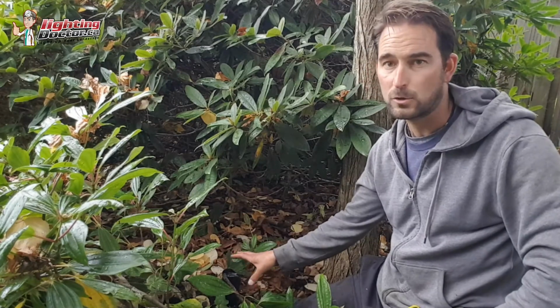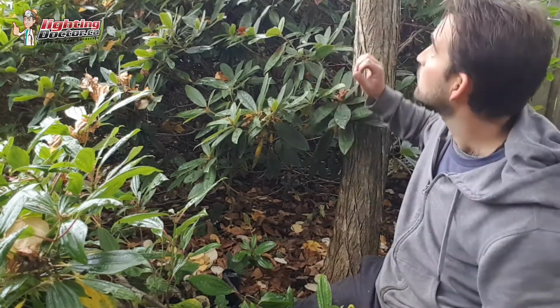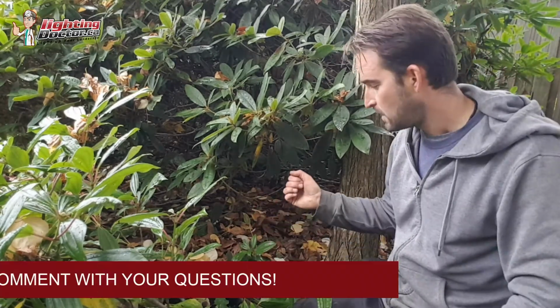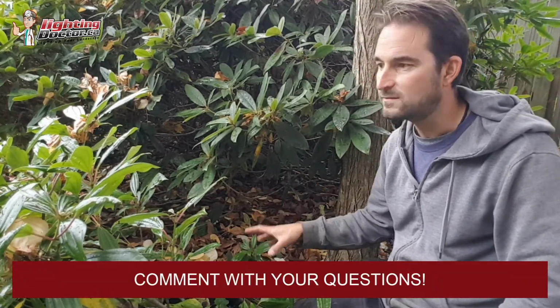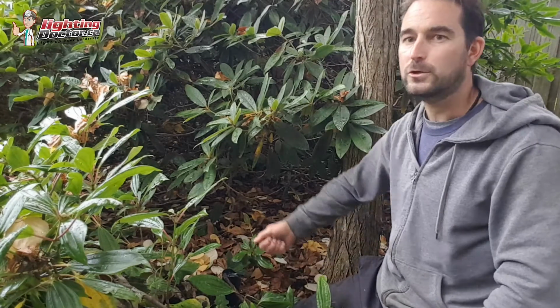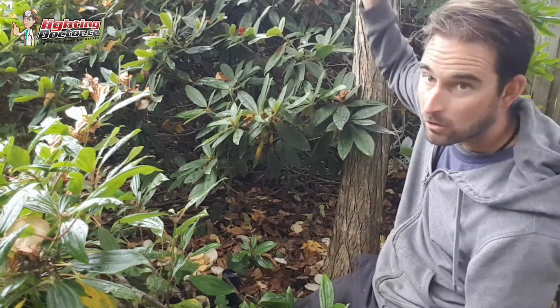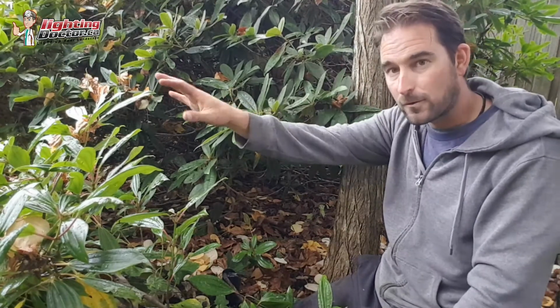Hey guys, so I just want to show you, we're going to use our accent light a whole bunch in this property. And a lot of common areas we're going to use that is on some nice trees. We got a really nice tree here that we're going to try and focus on. But one thing I see people do too often is instead of trying to get that light nice and close to the tree and having it shine up, so you're taking advantage of all the bark structure and then all the branching up top, they'll bring it far back and try and aim it at the tree.